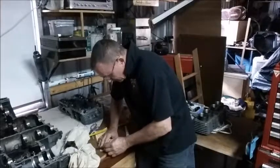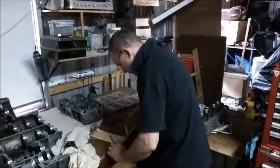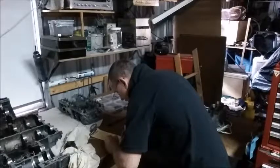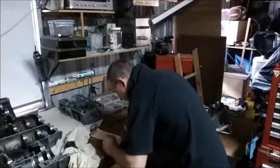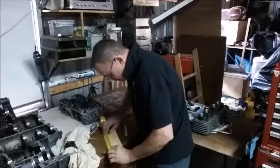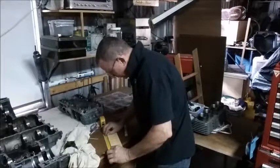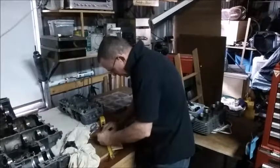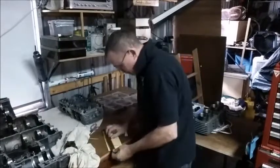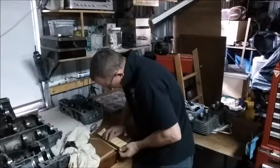So that will give us a nice base that we can put on our pedestal drill, and we come across here 4mm. Come up here 160mm. It's the 100, so that'll be 260mm. Like so. And then we draw a line from here to there.